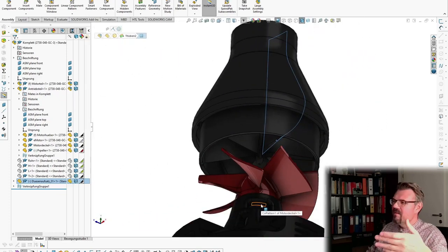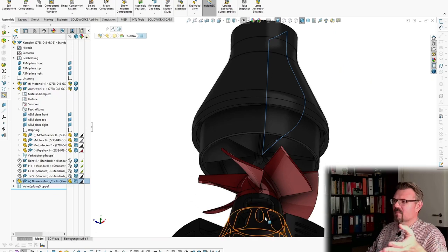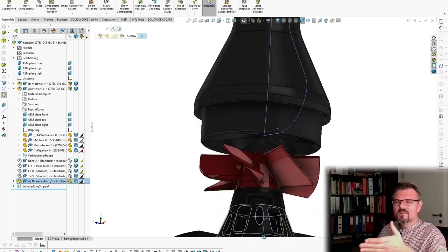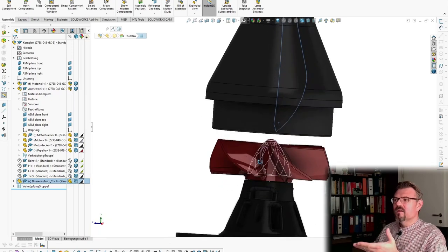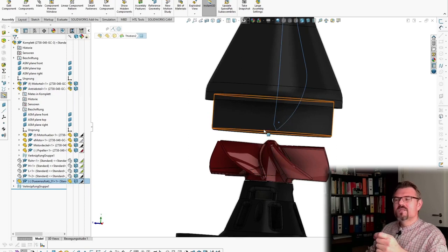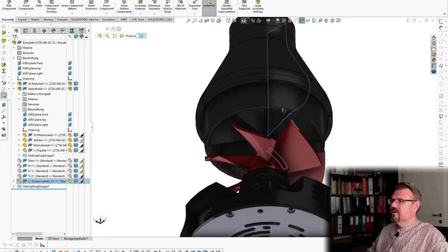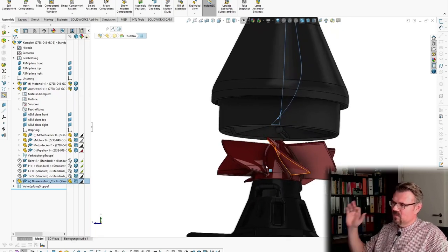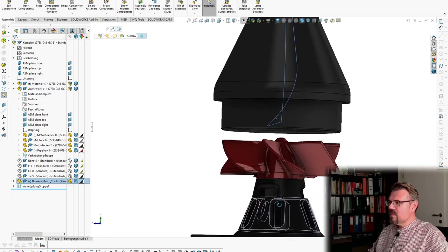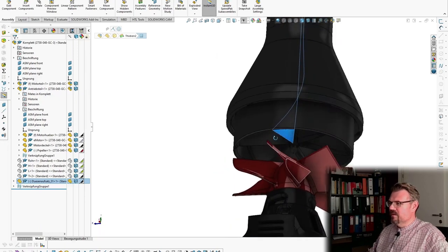It's always the same in every pump. It's also in water flows, in pumps and so on, and also if you have a compressor, axial compressor and so on. Yeah, this is how this is working. If you have more than one stage, you always have to put guide vanes in between to get rid of this radial whirlwind. All right, this is actually a pretty nice thing. I will do a video where I explain this in more detail, I guess. Sometime later, when we're talking about pumps and water turbines and so on, it's exactly the same issue there.